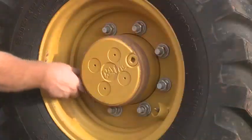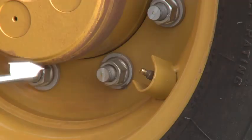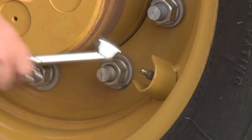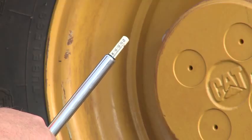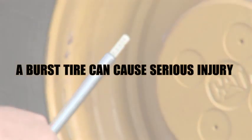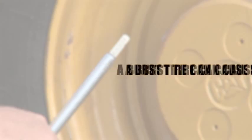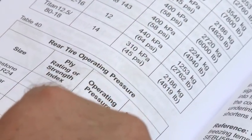Check the front and rear wheel nuts to ensure they are properly tightened. Also, check the tire pressure in each tire. Check the pressure on cold tires and be careful not to exceed the recommended pressure, as a burst tire can cause serious injury. Tire inflating pressure varies according to the load weighing on the axles.